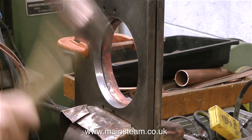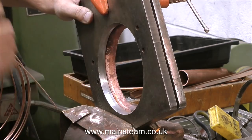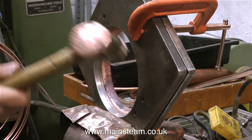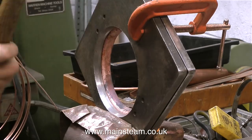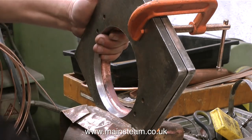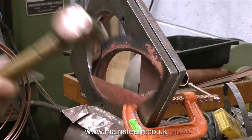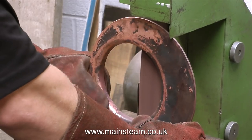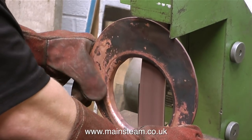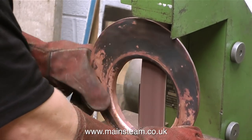The copper is now laying much flatter inside the ring. This is quite a labour-intensive job — it's not an easy job because if you get it wrong the copper is scrap, and copper is quite expensive. This video was recorded on Saturday the 19th of August at Black Gates Engineering, while Duncan is making these flange plates and his colleague Matt is packaging the rest of the boiler kit ready to be sent to the USA. Owing to the stretching of the copper it needs sorting out, and he's doing this on a belt sander — quite a large belt sander. Once the flange plate is finished it will be put in the sulphuric acid bath, which will remove all the scale and leave it a really nice coppery colour.